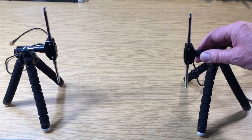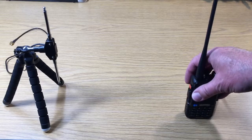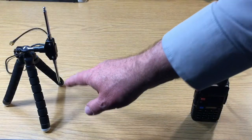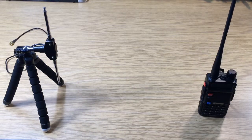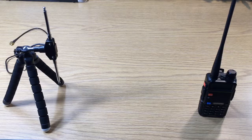So it's important to know whether the stations you're working with on your Baofeng UV5R are using a vertical or horizontal antenna. By common standards — basically the way things have evolved, which had a lot to do with mobile antennas — vertical antennas are used in FM communications on two meters. This would be a full size one-meter-high antenna, and this would be our Baofeng. But you notice this obviously isn't one meter, so it's not a half-wave dipole. Instead, it's an antenna that has inductance in it that shortens it to be resonant.